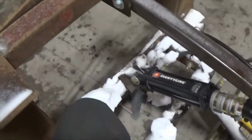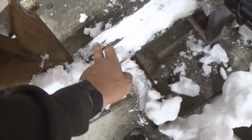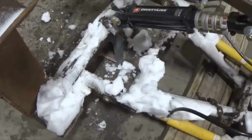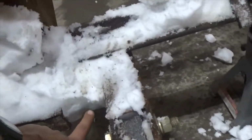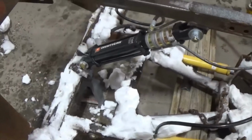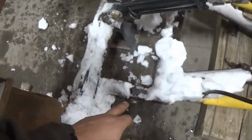What I did was there was this fairly heavy piece of angle iron running across here. That was there. Now I added this second piece, so now there is 1/2 inch of steel going across right here, and it's a 1/4 inch thick either side. What I did was I added to that this square tube, and I notched it so that the mounts for the plow would fit in there. And there is bracing underneath here that attaches all this together for extra support. So that is how the A-frame is connected to this frame. And we've used bolts instead of pins because that's what we had handy.